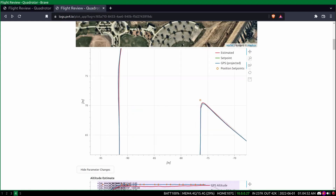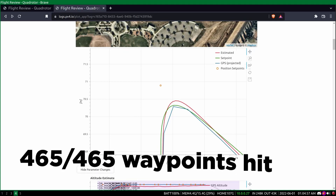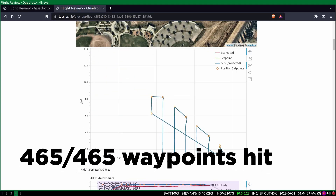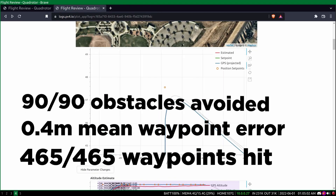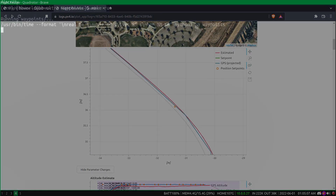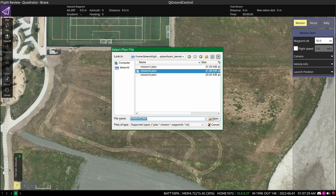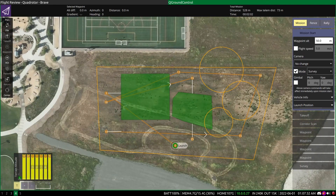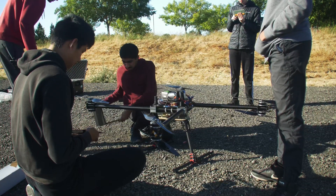The pilot simulation results further validated the efficacy of our missions: 465 out of 465 total waypoints hit with a mean waypoint error of 0.4 meters, 90 out of 90 total obstacles avoided with a minimum obstacle clearance of 5 meters, and a total distance of 50.5 kilometers traveled. The pilot path planning system was stress tested against various edge cases such as overlapping obstacles, obstacles covering entry points to surveys, and unavoidable paths going out of geofence to ensure that virtually all of them were handled, then further validated on both simulated and local tests.